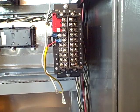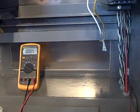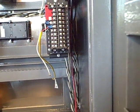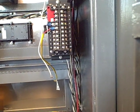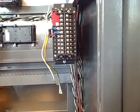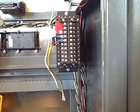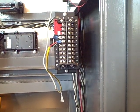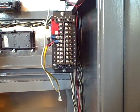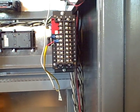Controller programming? I'm not with you on that, and here's why not. Notice you kept checking the wiring connections. Remember the scenario — this thing was working fine and just suddenly failed overnight. So wires don't swap themselves on their own. The odds of someone coming along and changing wiring is unlikely. What we're looking for is a failure more likely to happen in an existing working system — things like breaks, shorts, things of that nature.